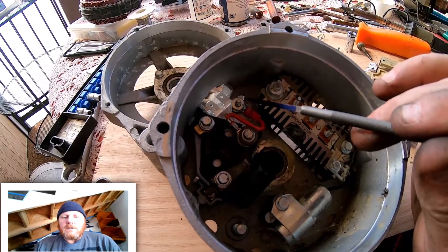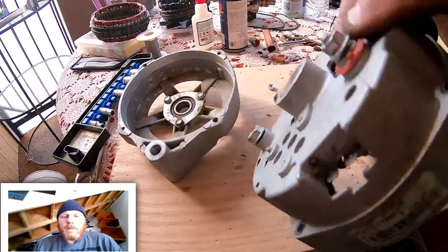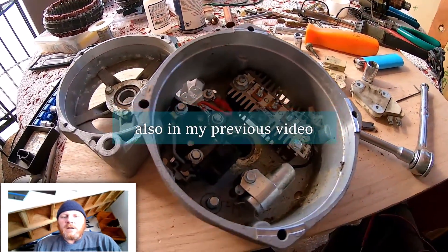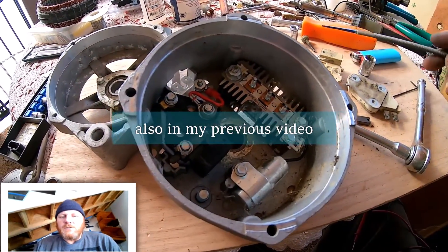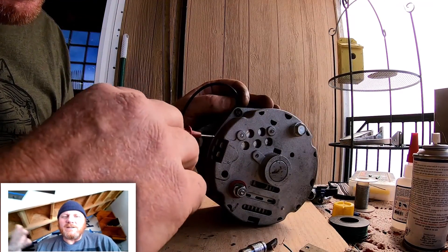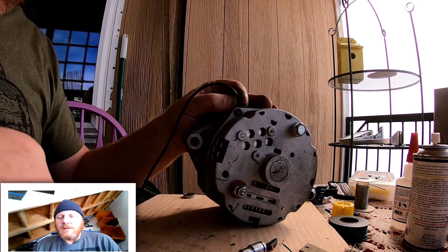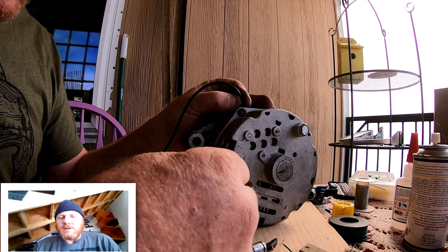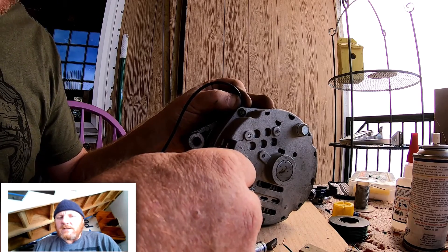I did several rotor repairs where I had to actually fix some broken wires in the rotor itself. I'm securing the wire there with some cyanoacrylate. This is probably video number three by now, and I'm pointing out some of the mistakes I made in video number two — mistakes I was able to discover and fix.